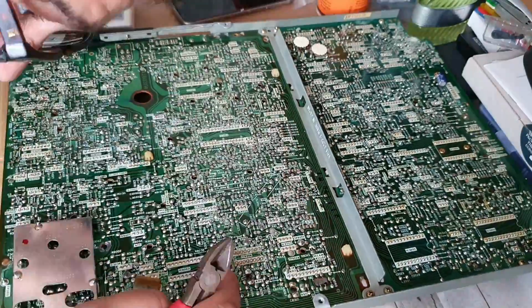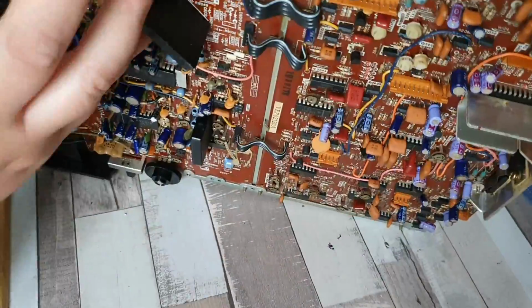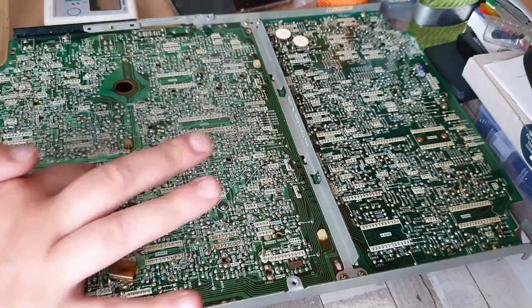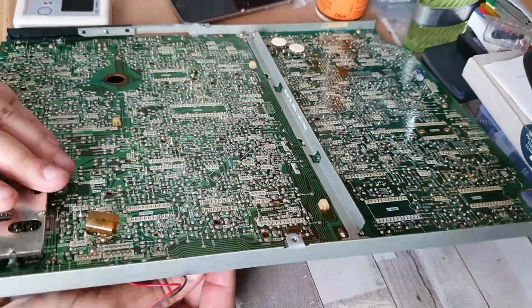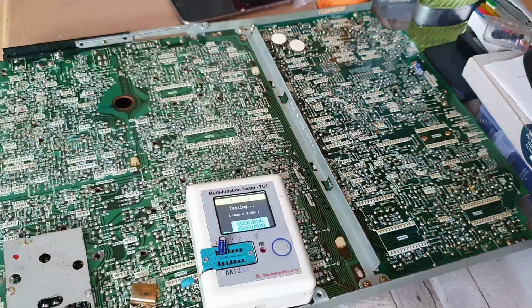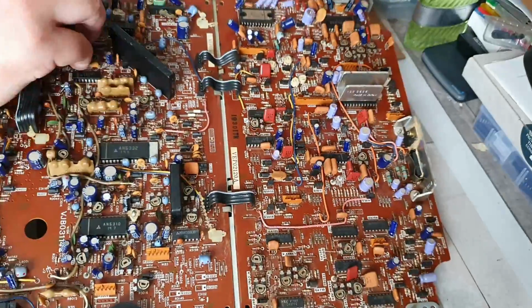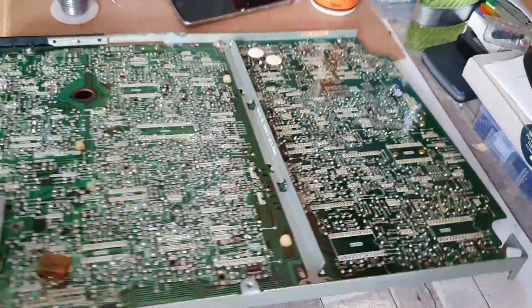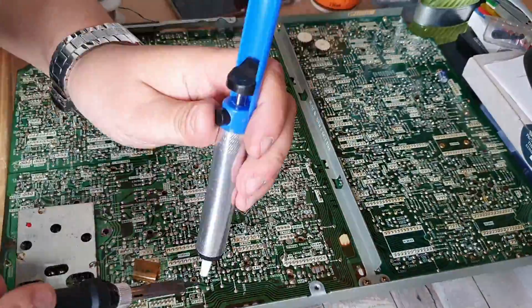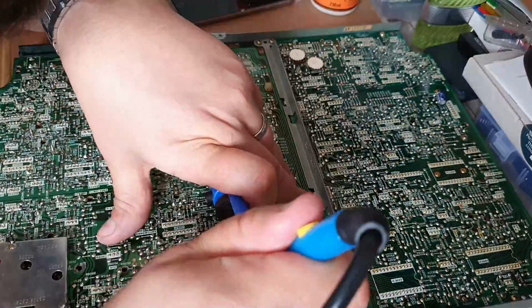The next time that I came to this, what I did was I took the board that I had from the original 1993 machine, both that and the servo board, and because I've never, as far as I know, touched any of the presets, I set all of the presets on both boards to effectively be at factory settings. Still no colour picture, still everything in black and white.